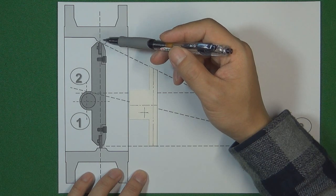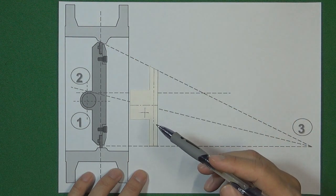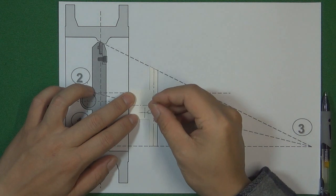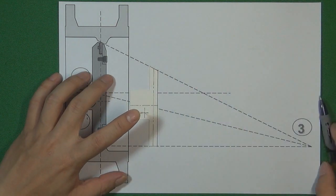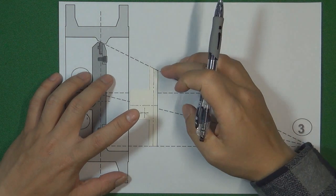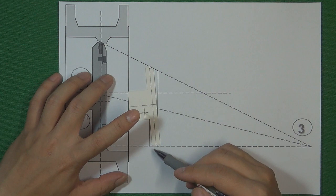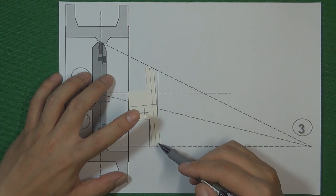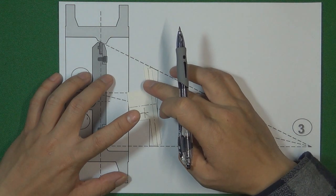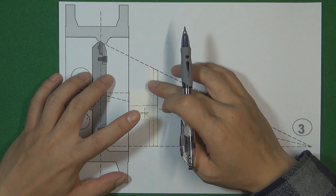The question is: when you use solid metal to make the valve disc and valve seat, and you open the butterfly valve, the valve disc and valve seat cannot have any rubbing. That is the reason we designed the triple offset butterfly valve — using triple offset so that when the valve disc opens, it immediately leaves the valve seat with no rubbing. So we can use solid metal for both disc and seat, and when opening and closing the valve, the seat and disc have no rubbing.